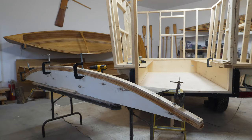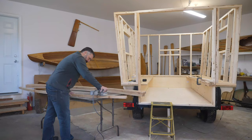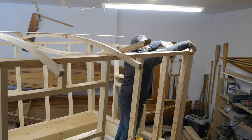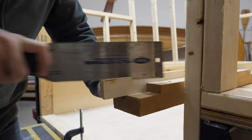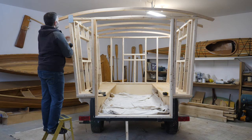I wanted the gypsy camper to have an arched roof, so first I built a form and then laminated up some long lengths of western red cedar to create the arched beams. Once I had enough roof beams, I put them in place and used some steel brackets to help secure them. There was a lot to consider: the overall length of the roof beam would determine the width of the roof and it had to stay within legal road requirements. Another consideration was the arch itself and how much headroom I'd have inside. I was hoping I could stand up comfortably. And probably the most important consideration was the overall height — I didn't want it too top heavy, and I needed to make sure I could get it back out the workshop door.